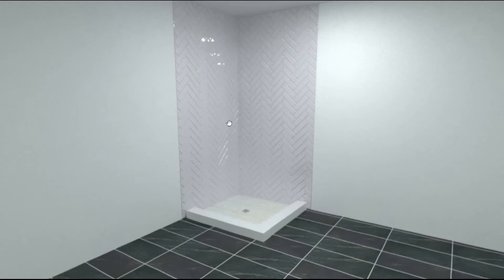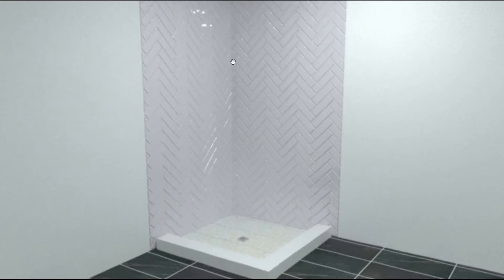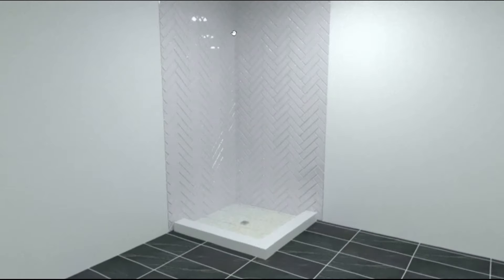The position of the pattern with respect to the adjacent wall is also important. When you're doing one wall and continuing the pattern onto another, the tile is sort of like bent - like a book match. The pattern continues so that if you were to lay both walls flat, you would not notice any seam or bend in the middle. You really want the pattern to flow and continue; you don't want a completely new pattern starting on the adjacent wall.